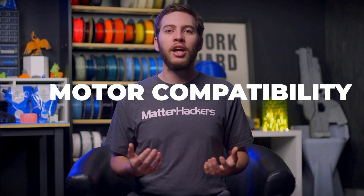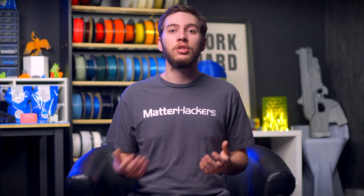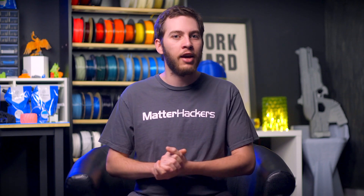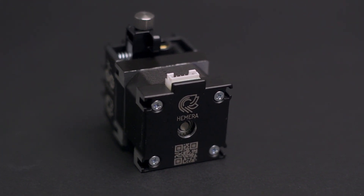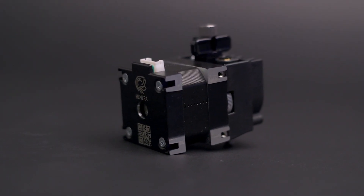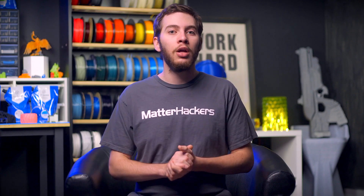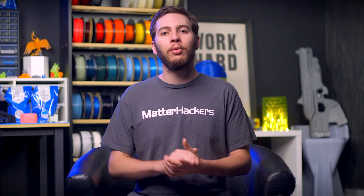The Titan extruders are all designed so that you can attach whatever motor fits their faceplate, which is a standard NEMA 17 profile motor. You can use a pancake or slimline motor for a direct drive configuration to reduce the weight of the carriage, or use a large and powerful motor strapped down as a Bowden extruder, ensuring printing complications aren't from a lack of extruder torque. Conversely, the E3D Hemera uses a unique NEMA 17 motor specifically to keep all of its components in a smaller footprint, with the gears embedded in the face of the motor. While this means you must use the included motor, E3D has done the testing to ensure the motor meets their quality caliber for a more reliable extruder overall.